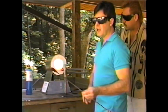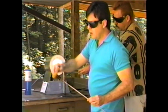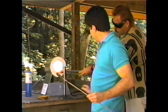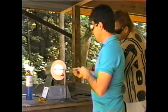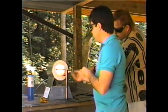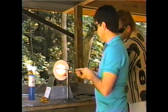If we do get little bits of insulation stuck to the liner, sometimes they'll come off just with a rag. Other times we'll have to heat the glass up and cut them off with a pair of tin snips. It's important to keep your marvering table clean. Any little garbage that's picked up in the glass will show up later.